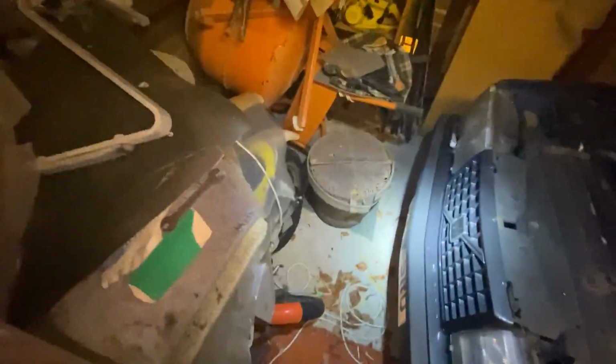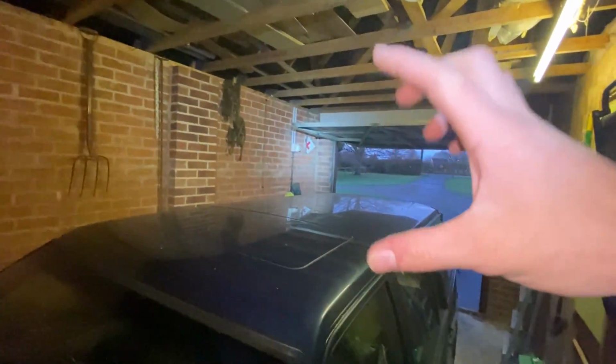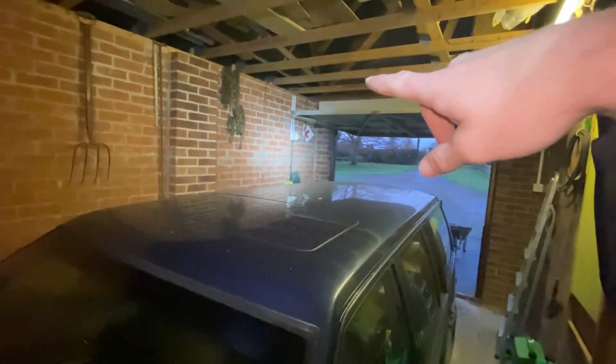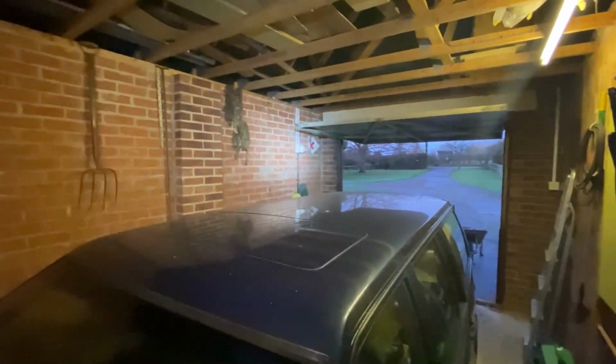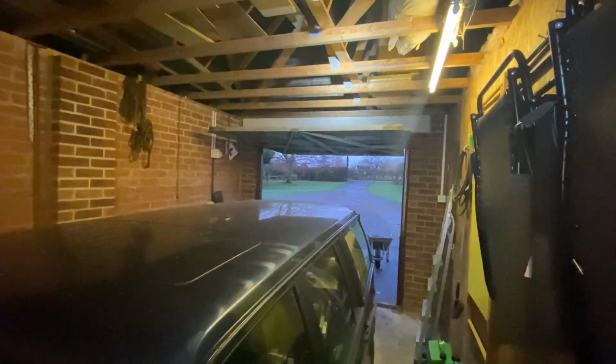Like I said before, it's run off a 16 amp MCB. It's quite an old board, as you can see. It's only that little white box. It's one of the old plastic ones, I think it's a Crabtree installation. There's a 6 amp MCB for the lights, which is two lights here and one next door. There's another side to this, but it's boarded off. There's a 16 amp MCB for just a radial socket, which I said last time goes down to there, so I just carried on up there. So yeah, I'm just getting this clipped in, and that's another install done.